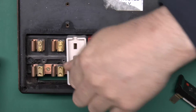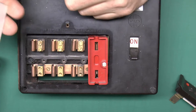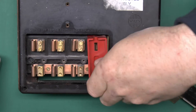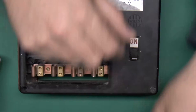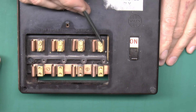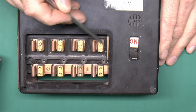All of these plastic outlets are fixed in with a single fixing screw and any one of them can be fitted in any of the positions — they're all actually identical inside. It's simply the shape of the plastic piece which determines which size fuse you can insert. The householder would not normally be taking these out; it's simply the fact of unplugging the fused part and replacing the wire if necessary. Inside, all the ways are exactly the same, with single fixing screws and two screws at the top for the wiring — a decent design with two screws clamping the wire rather than just a single one.